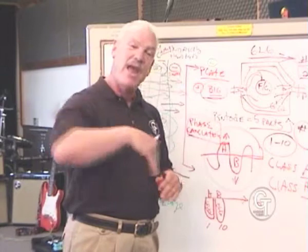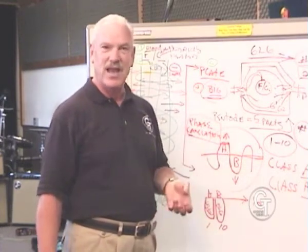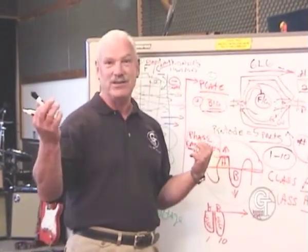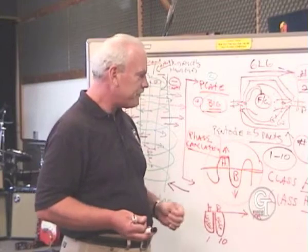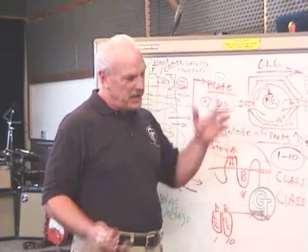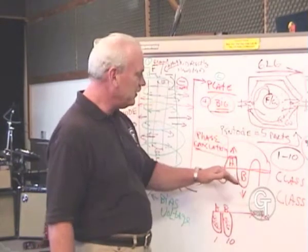As you play up and down the scale on your guitar, you may notice on a lousy-sounding amp that the low strings are mushy, the high strings don't sustain, but the mid-range strings sustain like Carlos Santana. Middle-range notes are easier to reproduce. Low and high frequencies are harder — it takes a bigger drum to make a bass note than a mid note, more energy and power. So with a very unmatched set of tubes, bass notes go mushy and high frequencies decay very quickly.